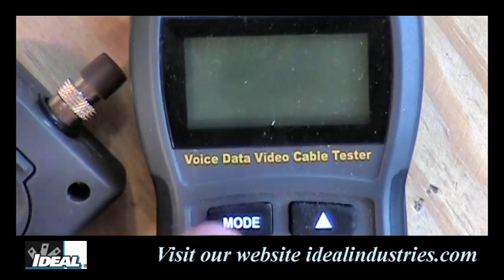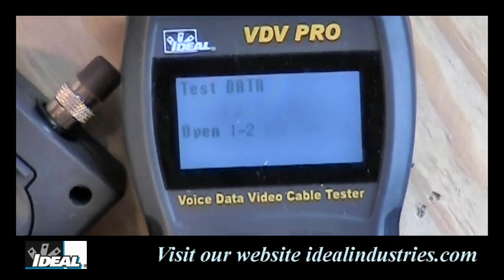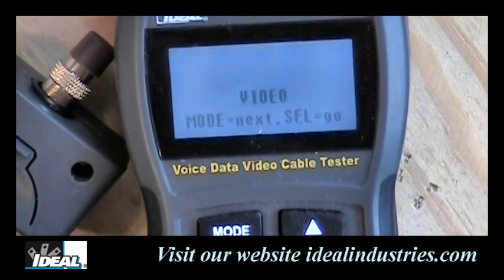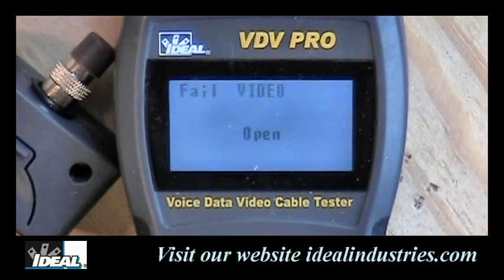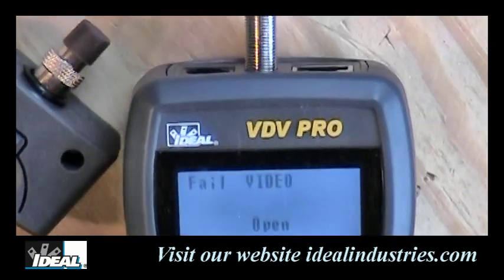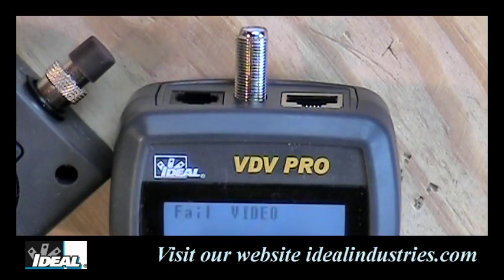So if I turn the tester on and it lights up and it gets into that data function, I'm going to hit that mode button until we get to video. And when I hit video, I'll hit the select button there. And now it's doing a test and looking for a coaxial cable. And you'll see it says fail and it says open because I basically don't have anything plugged into the top of the tester. Now, on the tester there, I can plug a cable into the end of it.